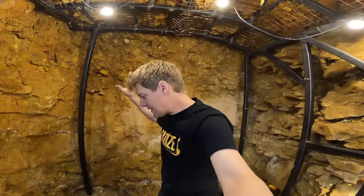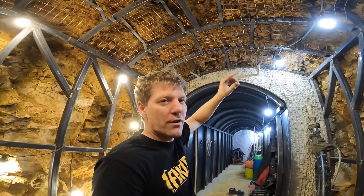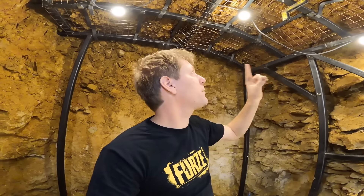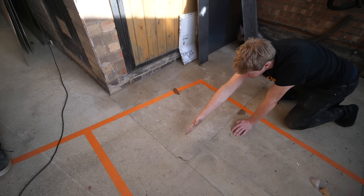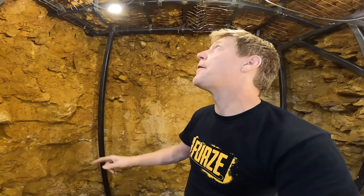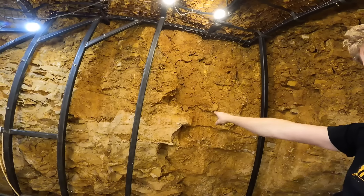It's all dug and supported. Next up we're going to drill another hole up to the surface. We've got the one in the far corner which will fill all that side up with concrete so it all moves forward - no air pockets. I want another one here to make sure this corner definitely gets everything. The only thing we need to worry about is on the back of my garage there used to be an outside toilet which I took down, so there is a sewer pipe and mains water pipe running under there - we just want to come this side of that so we don't puncture it. Over here at some point we've got the gas main to worry about, but that's for another day. We need to get it all steeled up, get it concreted up and safe, then we can start going towards the house.